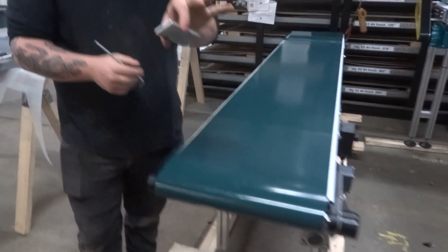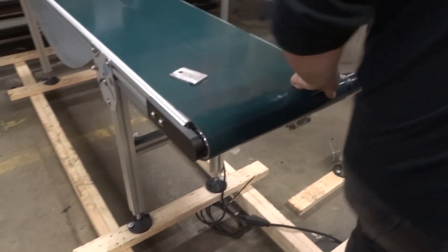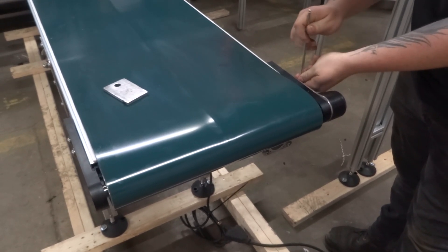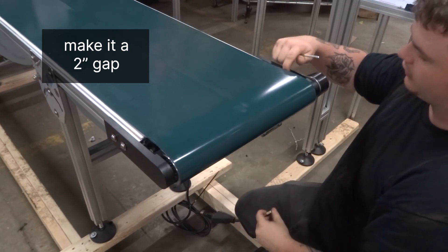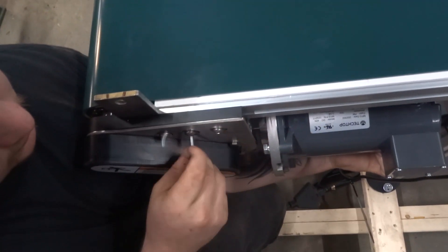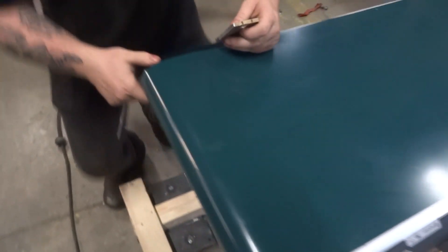What I have here is just a 2-inch block gauge. I'm going to loosen off the button heads on both sides of this here. And then all I'm going to do is pull it all out, and then I use this 2-inch block right into this gap for the extrusion. Then I'll go re-tighten the bolts. Same with the other side now.